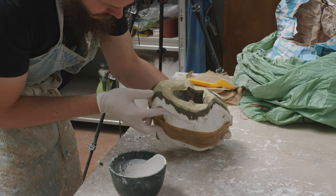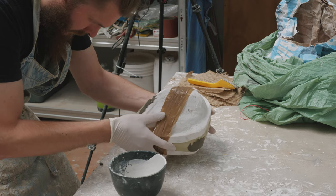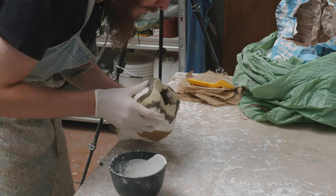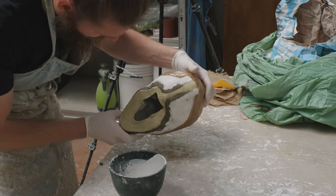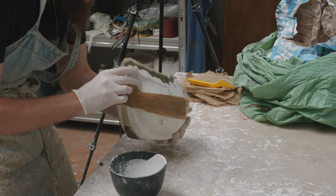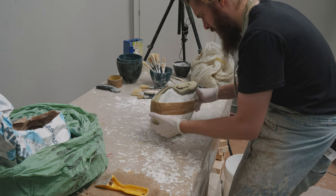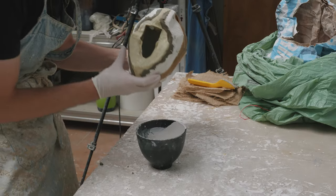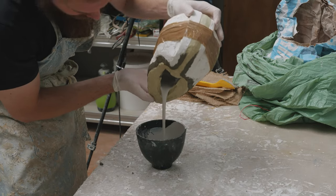When you make your molds, you want to think about how you plan to cast your sculpture inside it, as a mohawk mold doesn't make it easy to reinforce the casting with burlap, which might make this method unsuitable for certain types of figures. Getting burlap through this tiny opening at the bottom of the mold would be very difficult. There are certainly some more details to this, which we'll go into right now.